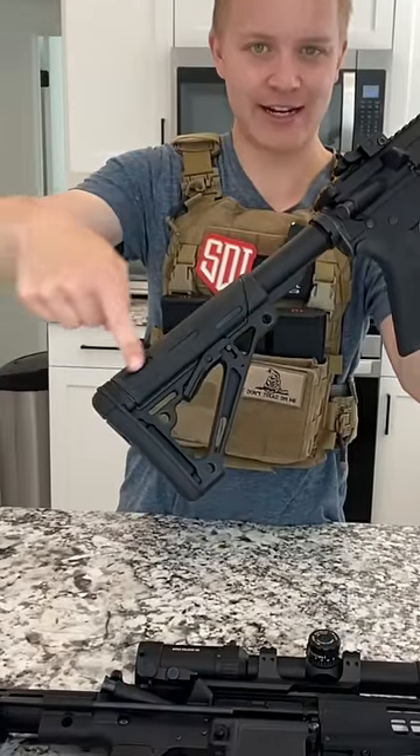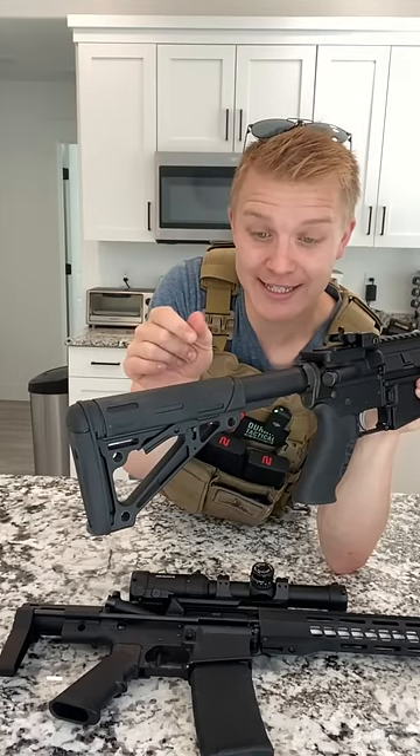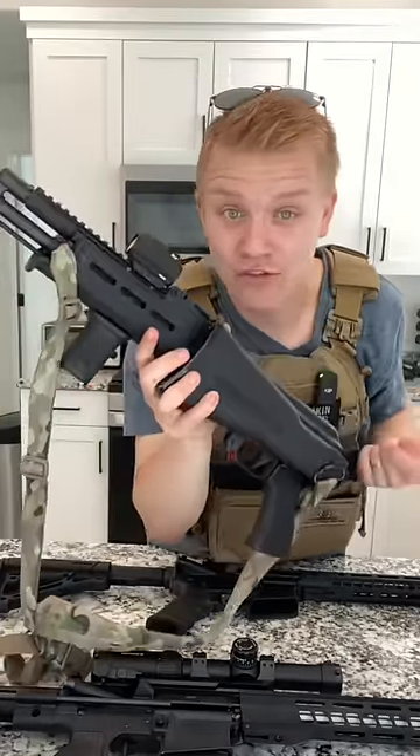And it is all of this right here. In the AR-15, your bolt carrier slides back here, and a spring with a plunger is compressed inside your stock, which means unlike the AK platform, you can't just fold it out of the way.